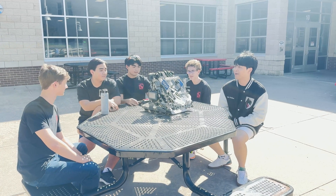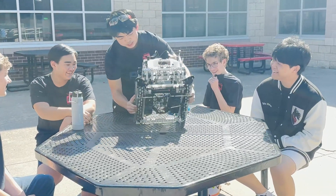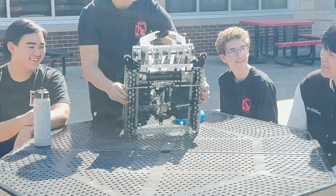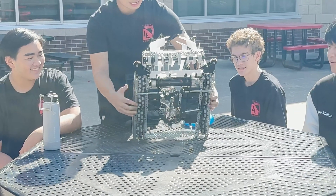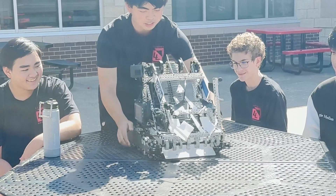Can I have one of the builders talk a little bit about the robot? As you can see, our drivetrain runs at 450 RPM — that's 600 RPM blue cartridges at a 3 to 4 ratio — and we have six motors on the drivetrain. Really speedy, really quick, helps us maneuver around the field quickly.